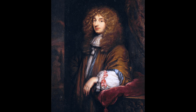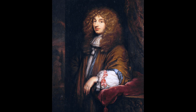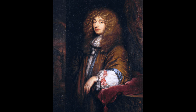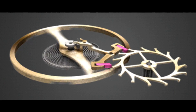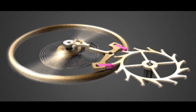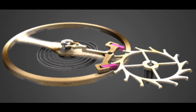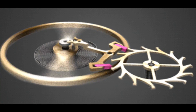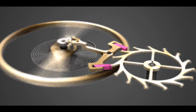There are rumours that Hooke, the very famous English scientist and polymath, also came to similar conclusions about balance wheels as far as timekeeping went, though this has fully been attributed to Huygens. The concept of the balance wheel is that you have effectively a compact, non-gravity-dependent version of a pendulum. This works by the fact that the balance wheel attached to the balance spring, when a force is applied, will oscillate backwards and forwards, and its period of oscillation — the length of time an oscillation takes — is constant.